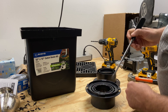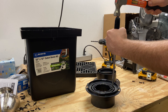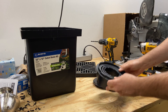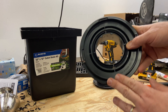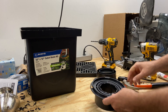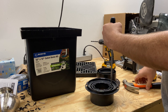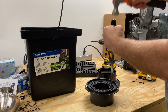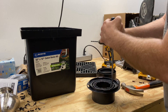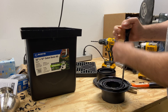What we're going to do is take our screwdriver, set it down inside the groove, and give it a smack on each one of these. As you do that, you'll notice it puts a small hole in the plastic, which is what we want. Go ahead and knock one there, move around to the next arrow, put it down into the end of the groove, give it a smack again, rotate around, and then one more time.